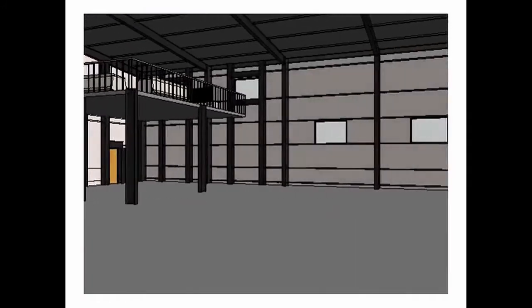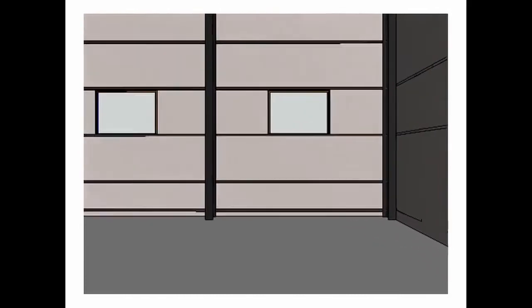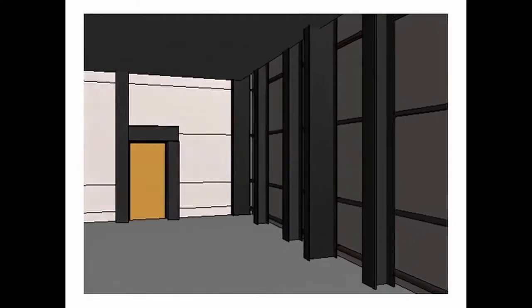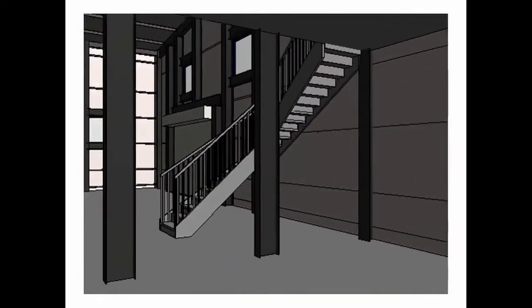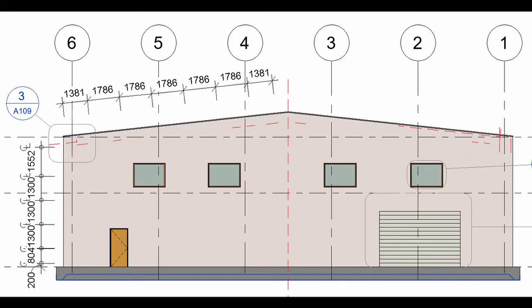The design could be improved by refining certain elements, for instance deleting an extra universal beam placed within the concrete slab. Several sources were consulted to determine the appropriate sizing of materials. These sources include, but are not limited to, the Lysaght Zs and Cs User's Guide and the Lysaght Spandeck Design and Installation Guide. The portal frame has some special features worth discussing.